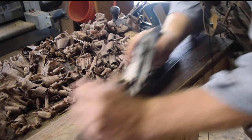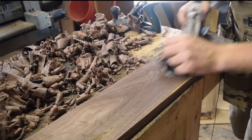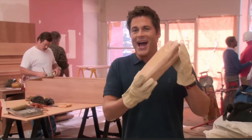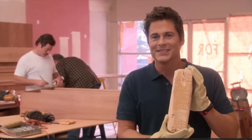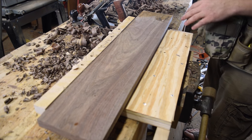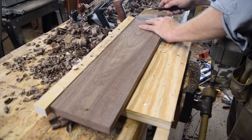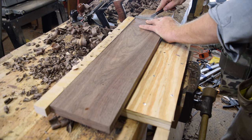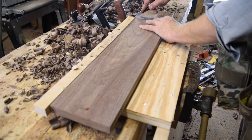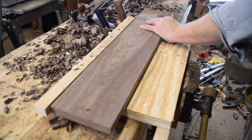Just got a little bit more to go, and we're there. You will want to work off your first face edge on both sides. Preferably, you'll want to mark your line with a knife so you can get a nice precise cut. Some people will cut right to the line, but I still like to use the line as a point of reference. Even though I don't put my saw blade into that kerf, it makes it a lot easier to square the board off on the shooting board after the fact.